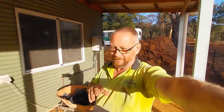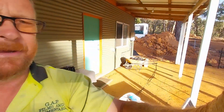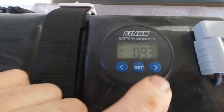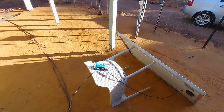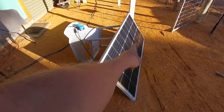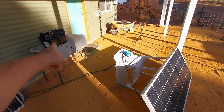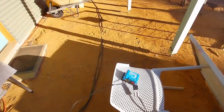First, the panel I want to have a look at here — the 100 amp hour battery. I've kind of hammered this down yesterday. We're just getting half an amp coming in. The panel I'm using is this 160 watt panel, courtesy of Dave — got to give a thumbs up to Dave. You can see a little shading there, so I'm waiting for the sun to come up more to top this battery off. I've got it going through the Victron controller here.